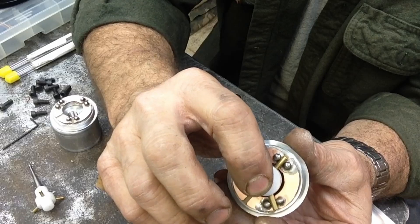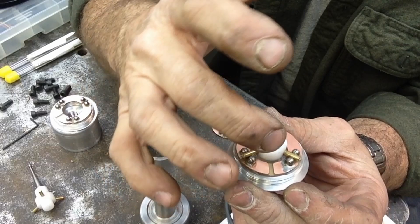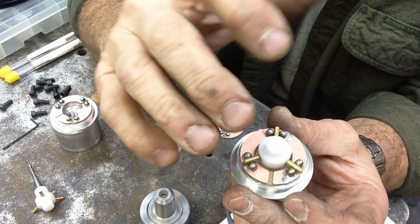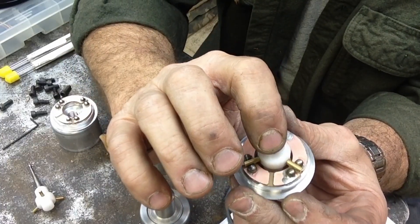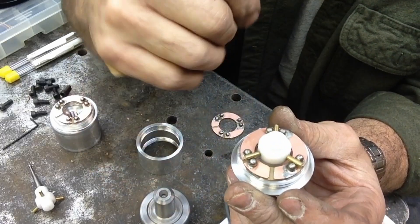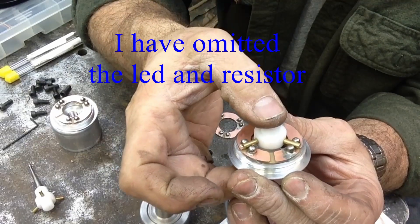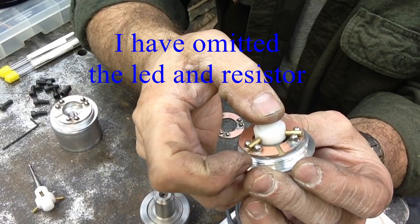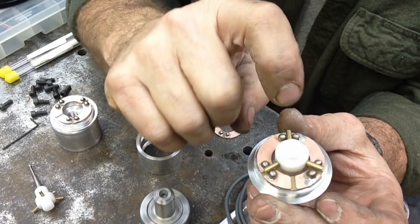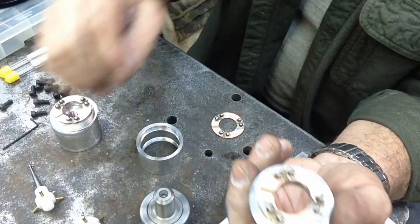Any direction at all — or up — will break the circuit at some point. A resistor and LED run across between those two contacts and should light when the circuit is broken, so power goes through that LED and resistor. I'm going to play with that a little bit because on my current probes they do not work. I'm not sure if it's my setup in Mach 3 or if I've got something wired wrong — I may have the LED and resistor reversed.